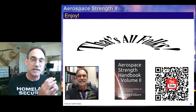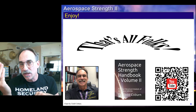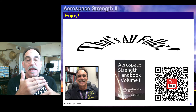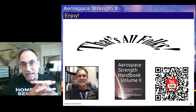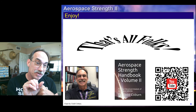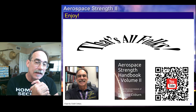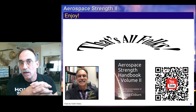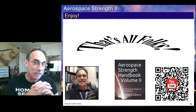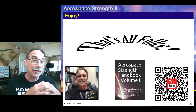So that's our basic process for assessing weld strength. For steels, we get the electrode FTU and the parent material FTY, then plug into the two formulas to get the allowable tension and shear strengths. For titaniums, aluminums, and pretty much anything else, we first demonstrate we have approved procedures for welding those materials, then specify a reheat treating of the material in order to utilize the heat-treating properties — whatever heat treat we do after welding, those are the properties we use, not before — unless you have test data demonstrating your part is not affected by the weld.